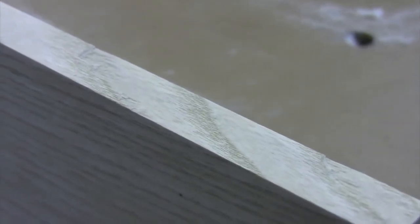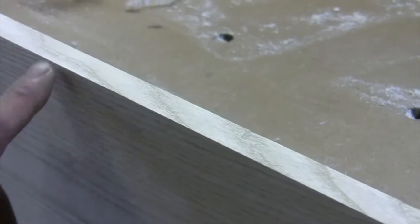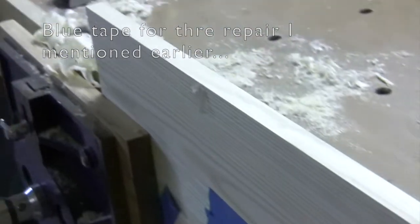I'm going to use my block plane, still with a 50 degree angle blade, very close mouth again. And what I'm going to do, I'm going to plane from this bit this way, where the grain is going up this way, and then starting from the center going up as the grain changes direction. So now it's flat, and managed to remove the bit missing that was there, so very happy with that, and it has already been jointed, with a nice straight side edge.